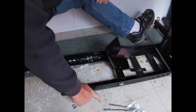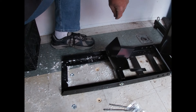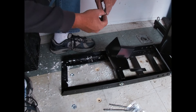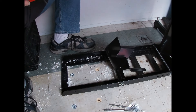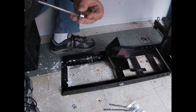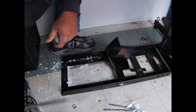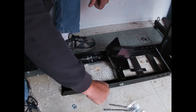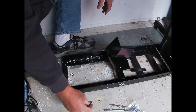Hey guys, I apologize — I forgot to turn the camera back on. I'm going to run and get some different screws, but I went ahead and drilled my pilot holes out here. What I did was I used the three-eighths inch hole here. I started the hole, and then once I got down — the floor's got tile on it — I stepped it up to this one inch, to bring it out here so this thing will fit flush down to the floor, whenever I do put a new floor in, which is kind of on my plans.